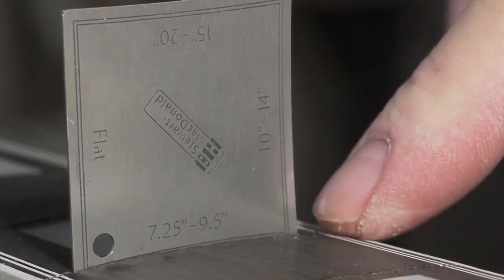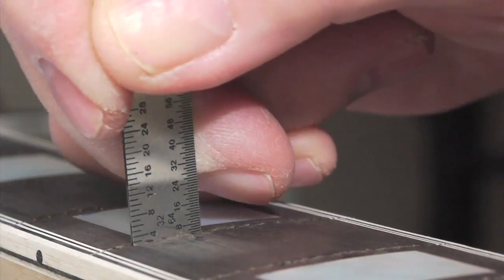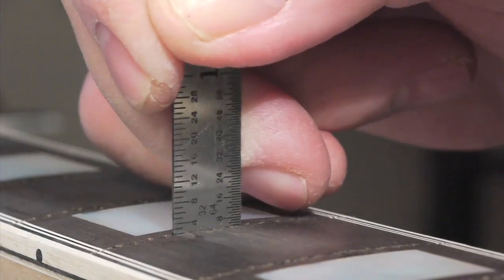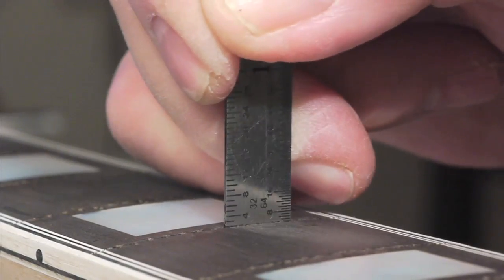I'm deep enough there, but I'm really not deep enough here. The 6-inch pocket rule isn't the best way to measure slot depth because they're too thick — about 23 or 24 thousandths — and they can't get down into a tight slot. And when they do fit the slot, they teeter and they're sort of hard to read, or they get stuck down in the slot and can easily miss one small irregularity in the fret slot's depth.